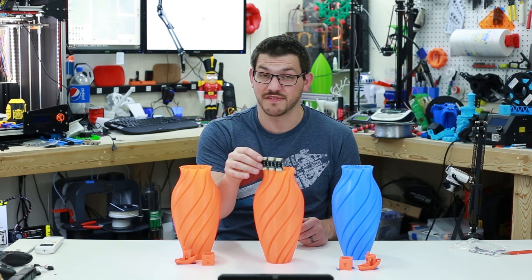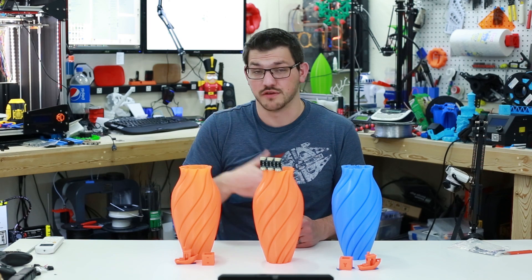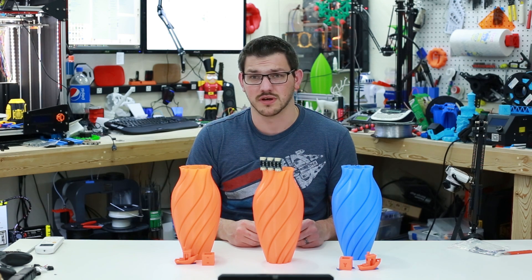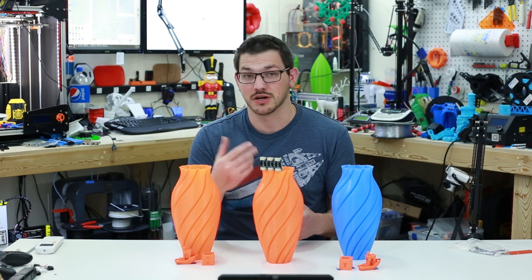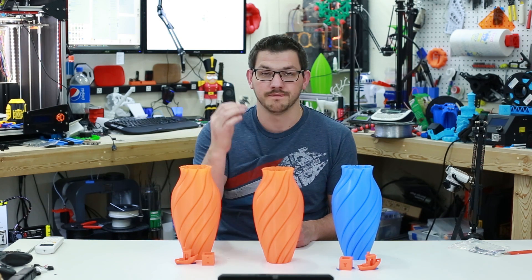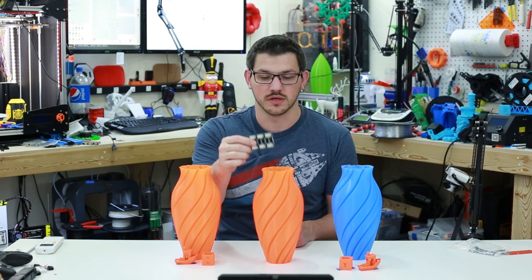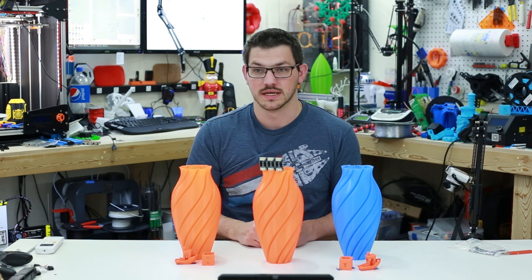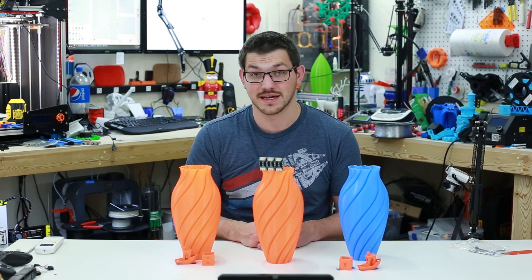A set of these drivers costs about five bucks for three or four of them, depending on who and where you buy from. I'll put some links down below to the ones I bought and a few others. These all came from AliExpress, which took a month to get. I ordered the four-diode ones first, found out the eight-diode drivers are supposed to be better, so then I ordered the eights — total cost me 10 bucks for the two sets. I am using the eight-diode ones currently on that printer on the X, Y, and Z, and one four-diode driver for the extruder to help smooth that out a little bit. And obviously this came out really well — everything I've printed since then has just been great.